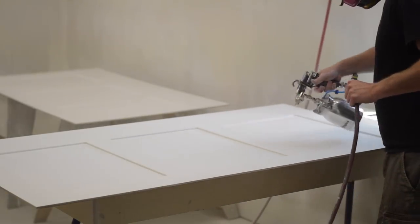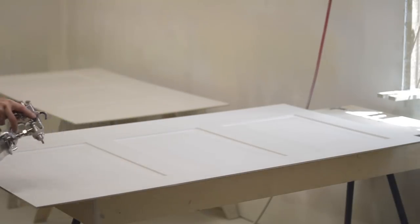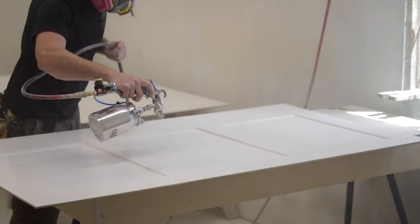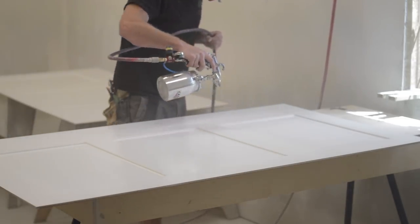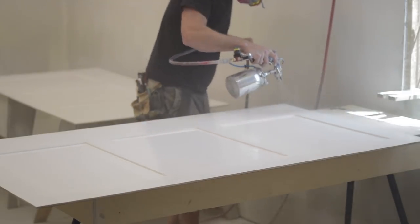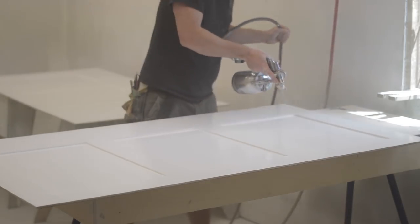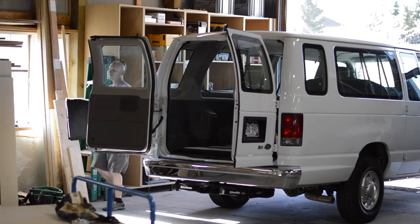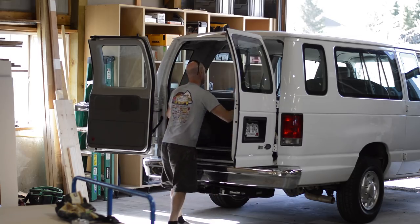It's time to spray some paint. I'm using Sherwin-Williams Pro Classic, tinted to match the rest of the trim in the house. My spraying process is exactly like before - I spray the inside edges, then do two back-to-back coats of paint, spraying fairly light coats, really as thin a coat as will flow out. I'm using a conventional spray gun, not an HVLP gun - I have independent controls over the pressure to the material and the pressure from the air cap, which gives me really good control and a glassy smooth surface. When spraying water-based paints like Pro Classic, I let them dry for at least a couple of days - in this case, three days before loading up and taking everything to the job site.